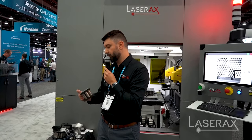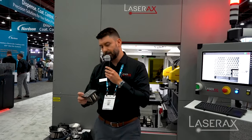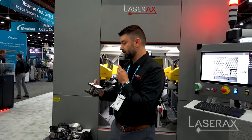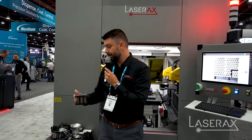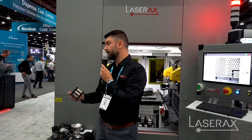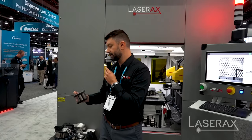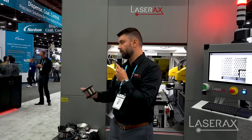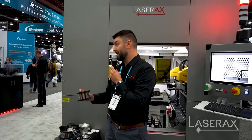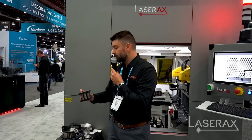It's really important because we need to offset the welding and the clamping position. For those who know, or I encourage you to have a closer look at the mini module after — the negative rim on a cell like this is about one millimeter, and we need to place a 0.5 millimeter weld precisely. In the real world, inherent manufacturing stack of tolerances means that without correction, the weld could land on the gasket or at the periphery.